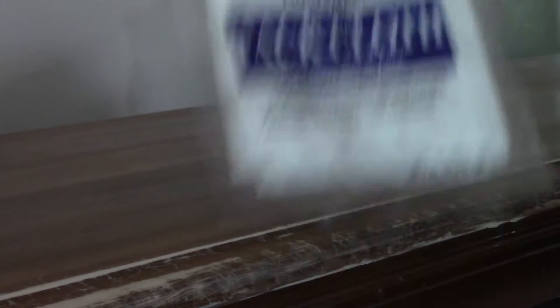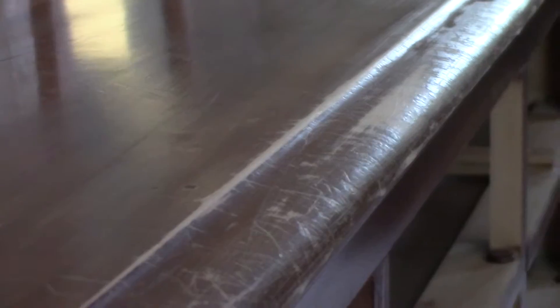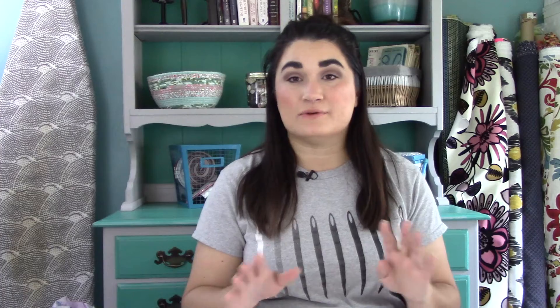A tack cloth is a must-have if you're doing any type of furniture redo and you've had to sand. It's really gooey and sticky — you almost have to use Dawn dish soap to get the gooeyness off your hands — but it will wipe up all of the dust, debris, and anything else that's leftover. In this one especially, with so much extra dust, I wanted to make sure I got all of that off so it didn't get caught in the paint and ruin the finish. You can see the area in the front where it had gotten all scratched up. Once I'd gone over that with the wood filler and then the sanding sponge, everything was very nice and smooth, which prepared it to have a great finish where you couldn't tell there had been any damage.